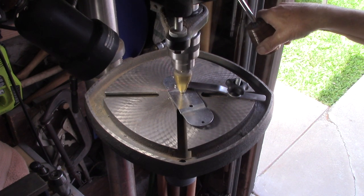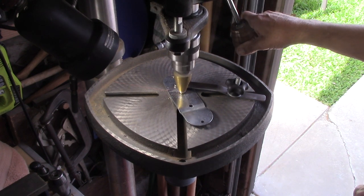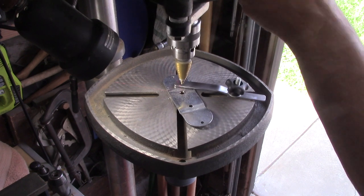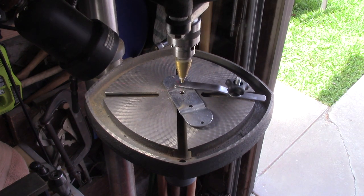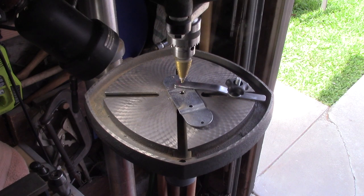Here's a warning for you. This works great on little pieces of wood. But if you're going to do metal, I only have one contact point with my clamp, and that could catch and pivot and spin around. So I would advise you to have two contact points — make a second one of these for extra safety. I hope you give this a try. It's easy. You can do it in about an hour. Have a nice day.